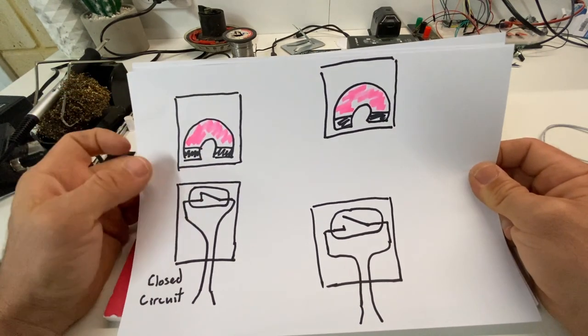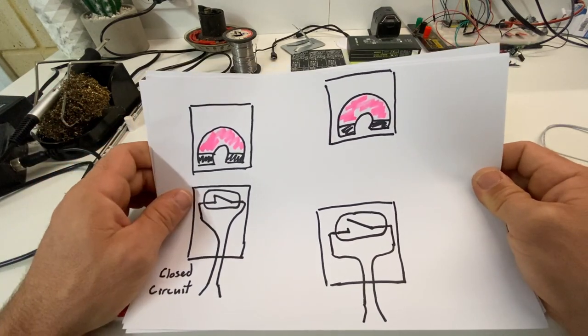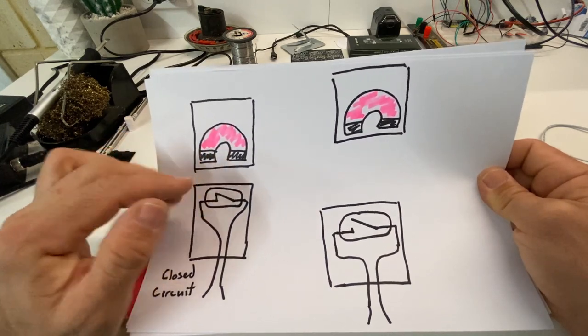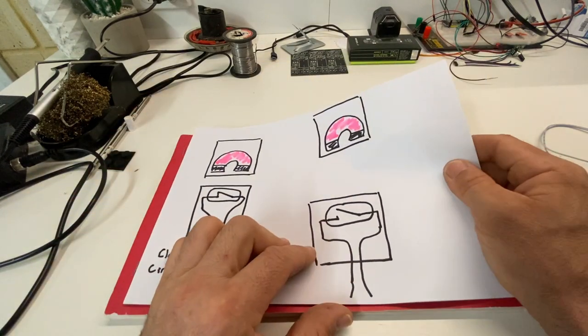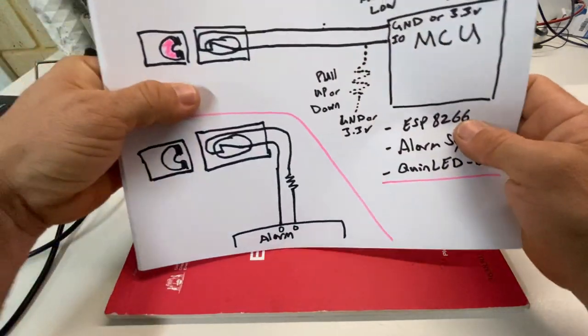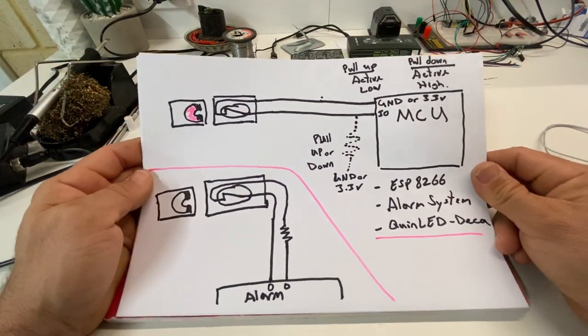And of course, when we move back, we know that something's changed back again. And so we can use this to know whether a door is open, whether it's shut. We have two of these, and we can know whether our roller door is open or whether our roller door is shut. So that's the basic operation of the reed switches. They're very simple, they're low cost, and as I said before, they're good for creating automations and knowing what state your house is in. So this is how you might use this switch.